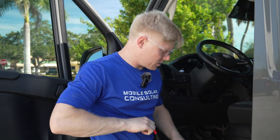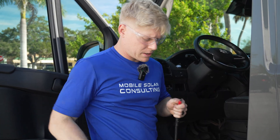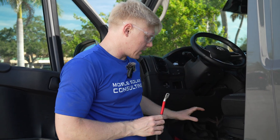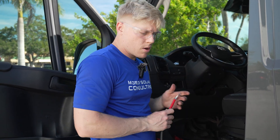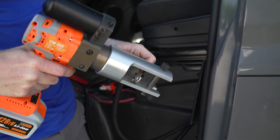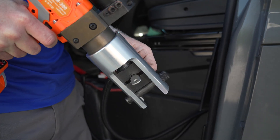We've got a positive and negative wire up into the front area. We're now stripping and crimping them, and once we get them landed on the starter battery we'll be able to tidy up the wiring and start pulling out the slack and running the rest of the wire underneath the vehicle. This auto crimper is a lifesaver for working in tight spaces — we got it on Amazon and I'll link it in the description.